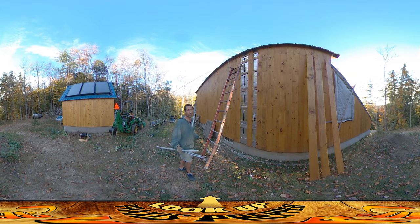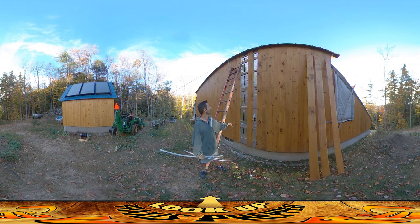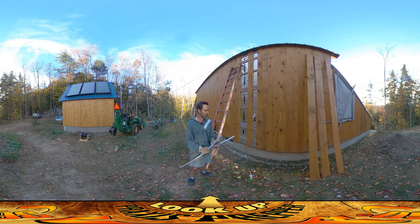I want to do this video about what this is. This is the wiring run that has the wires go from the room down in the utility area — that's going to have the batteries and all the inverters and everything — up through this wall and then underneath the roof. We were running the wires underneath the metal roof, under one of these little bumps on the ribs up there, and it's going through this half-inch EMT conduit.